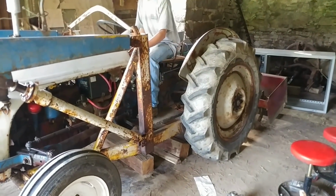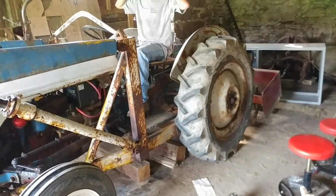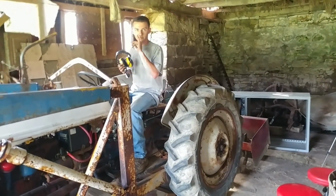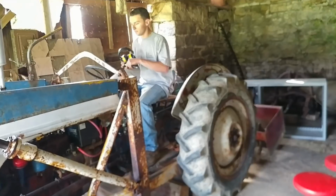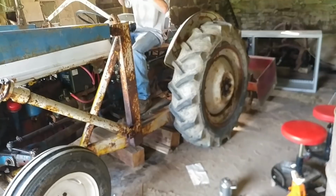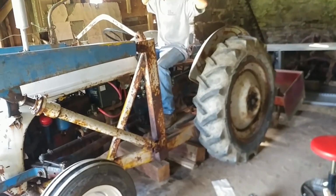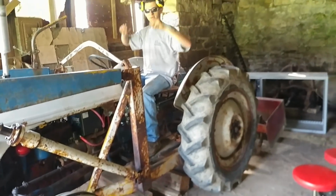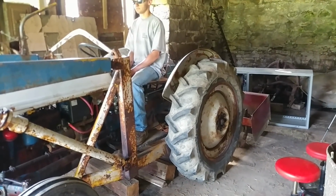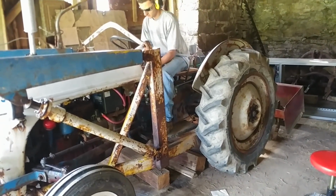So we adjusted the brakes. I think there was oil on the shoes, and that spring was in the wrong spot, which made the pedal harder to push down on, so hopefully this fixed it. We cleaned the brake pads and the brake drum. The brake drum had some wear in it. It was probably about a 1/16 of an inch of steel that's been worn away. So I guess we're gonna fire it up and see how it stops now.